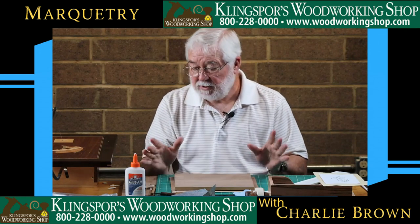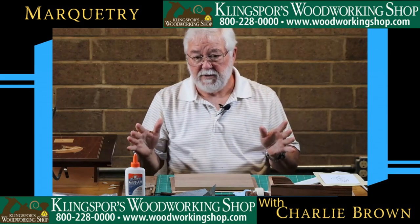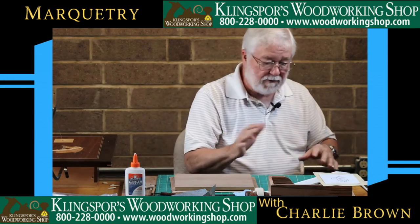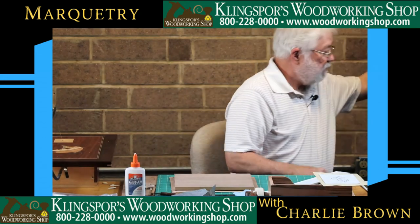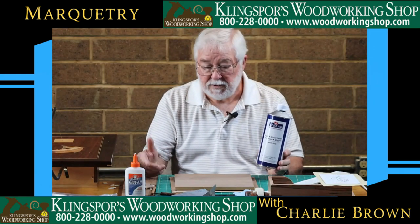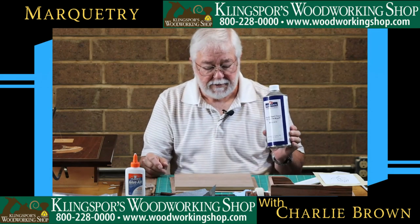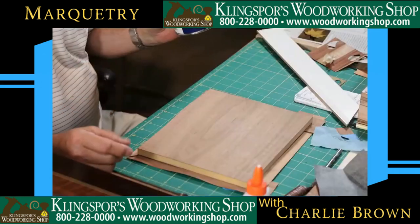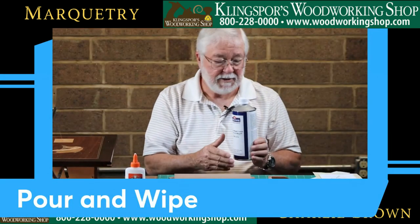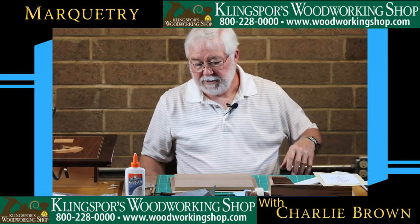The finish is the only thing that we didn't discuss here today, and there's a variety of finishes that you can put on your picture. The one I like is a wipe-on finish, and it's this one right here. It's a little thinner than most wipe-ons. It's available here at Klingspor. I really like that product, and usually I put on 3 coats. It dries fairly quickly. Just wipe it on, make sure you don't have any streaks in it, and that's what I would recommend to you, although you can use various other things.